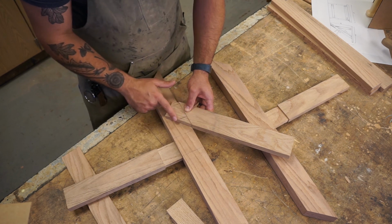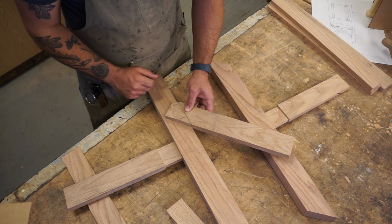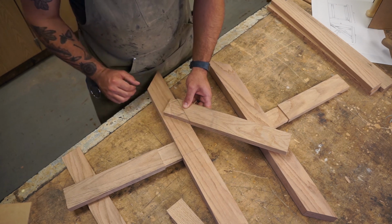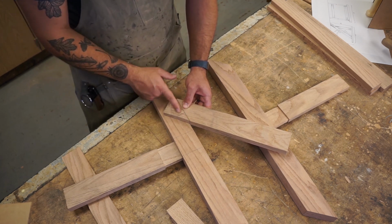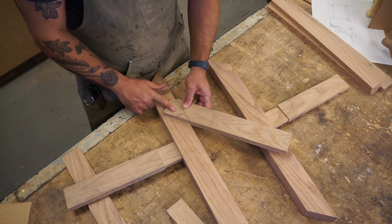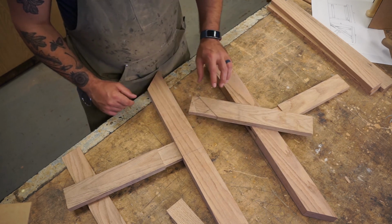So it allows me to do that just straight in, drill out all my holes. I'm going to just use a mortiser because that's going to be the simplest way for me to go about it. But now I need to make all my marks, plan that out. I can cut down my tenon, but I'm going to wait to do my finishing cutting down of my tenon until I have this a little bit more mapped out, just so I don't remove too much material,